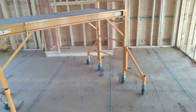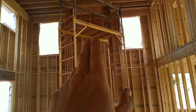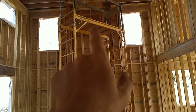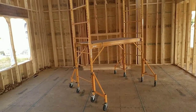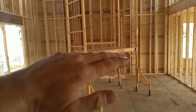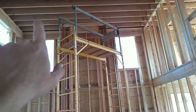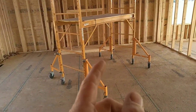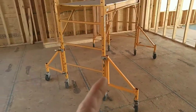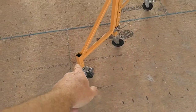This video is to inform you about these Baker look-alike scaffolds. I believe this one's a Franklin brand. I've had this one about 12 years, the other one's about six years old — try to keep them in the shed under cover. I've got a total of four sets of single buck sets, so I can have a two-man crew doing an acoustical ceiling tile. If you've got employees, have them check these daily connection points, making sure everything is tight and everything is pinned. I'm running a little short on pins right now — I'll be going to the store tonight to buy some more.